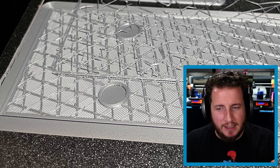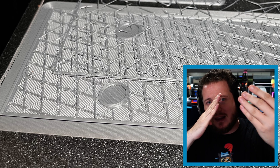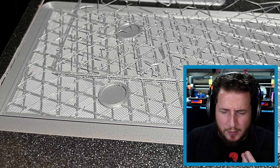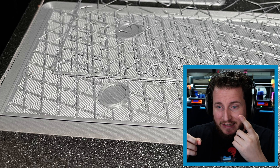You might have some belt length issues. For CoreXYs, if your belts aren't perfect or darn near perfect, the machine won't actually do good circles or proper anything. It'll be kind of askew. I believe we might be running a little bit too cold. My thought is that because it's too cold, our infill lines aren't connecting, they're sticking up a little bit, and the print head is knocking into it and causing these layer shifts.